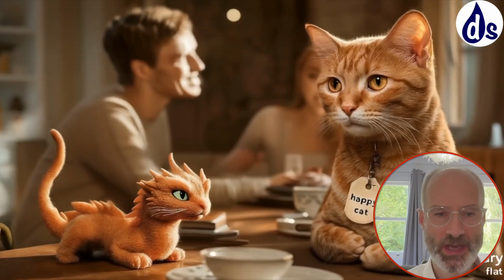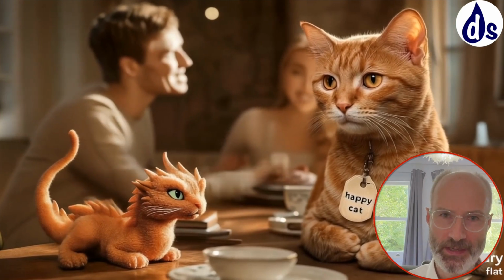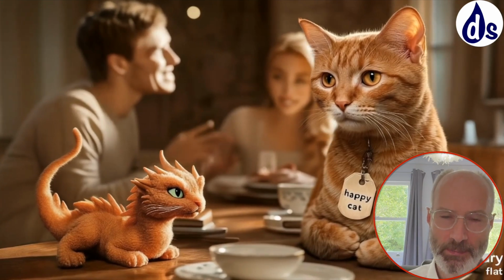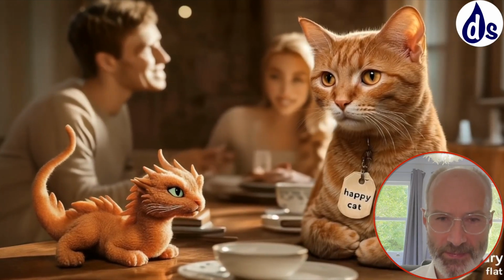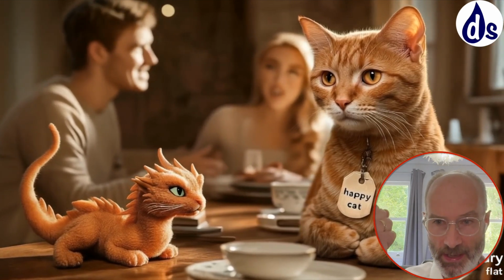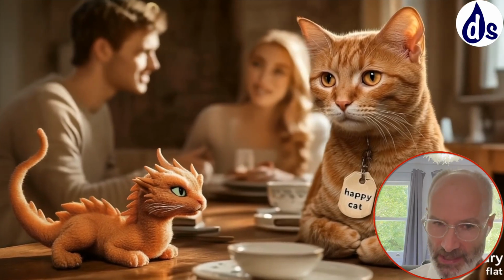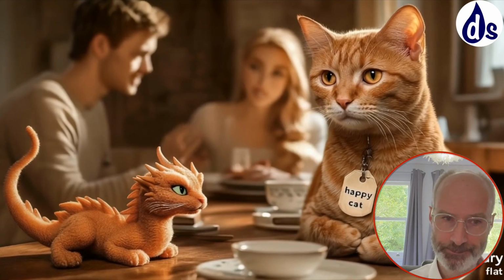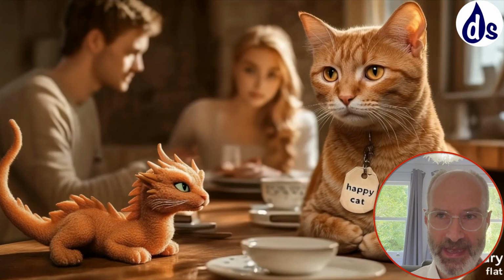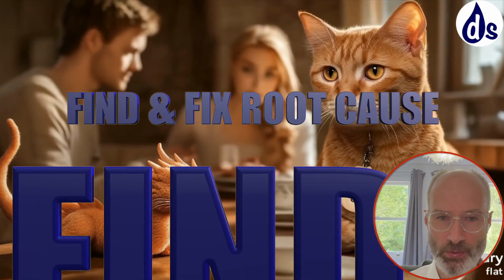So the key issues are that the penetrating damp is getting through the paintwork on the outside. So you want to wire brush that back and repaint it with an impermeable paint. You want to keep down the internal vapor levels by using a much more powerful 20 litre plus dehumidifier, especially close to drying clothes. You want to monitor and maintain the internal dew point below the external temperature at all times.